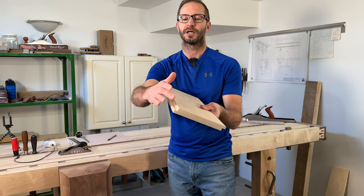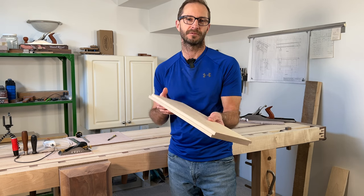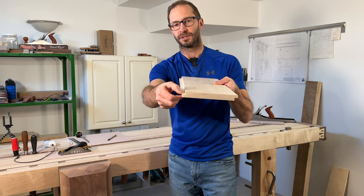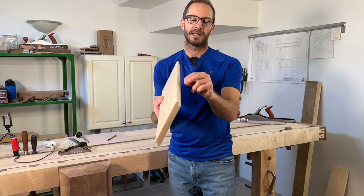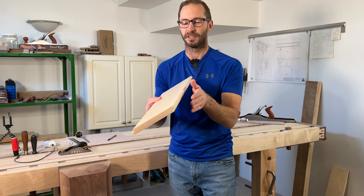In this video I'm going to show you how to cut a chamfer by hand using a block plane, because sometimes you can't use a bearing guided chamfer bit in a router — as in this case, because the bearing will actually hit the bottom part of the shiplap. On the other side, the mating one, you can't get the bearing to ride along the edge because there's not enough material for the bearing to actually seat up against.